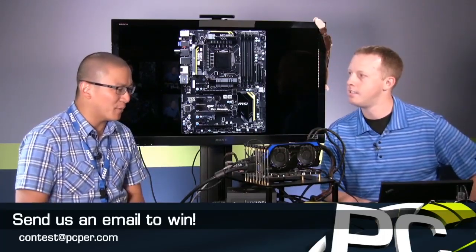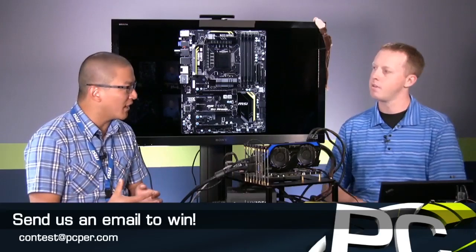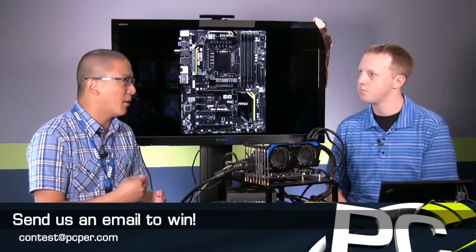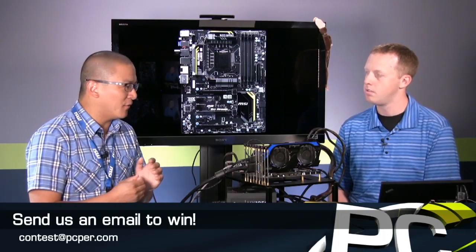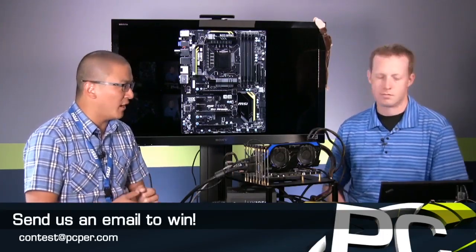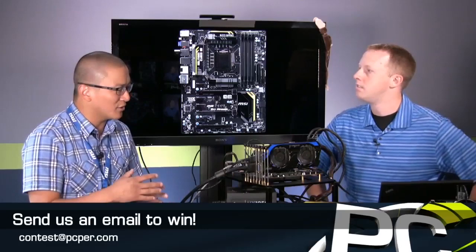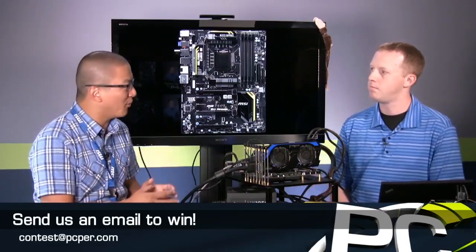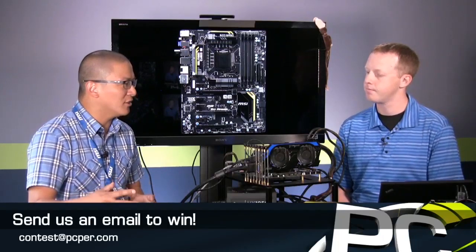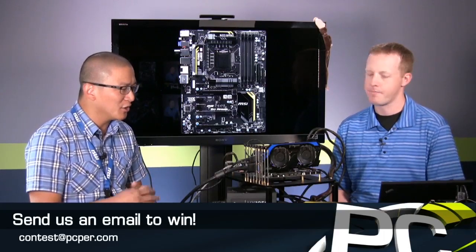It's about 6 months from the time we get the chip, the engineering samples, to once we have a reference design for the board, and then we start qualifying stuff. With a graphics card you have a reference design, but once you start adding new stuff, it becomes more and more complicated. You have to test, and if there's a new memory configuration, like quad channel, or even a new memory controller, you have to qualify all of the memory too. It's not just throw in this memory and it works. There's a long, complicated process behind it. Every single board that we make, whether it's a $300, $100 or $50 board, has a long list of memories that we have to qualify, and the faster the memory or the newer the module, usually the more time you spend qualifying it. That's the nitty gritty stuff. So generally speaking, it's about 6 months.